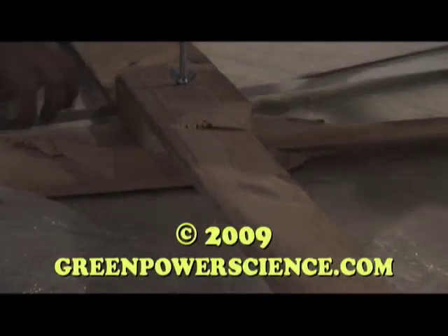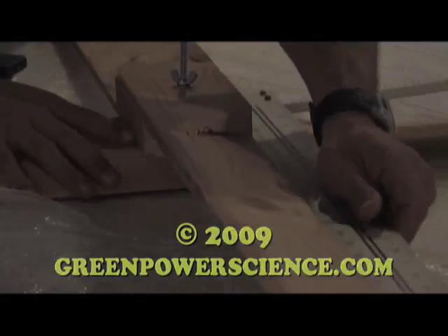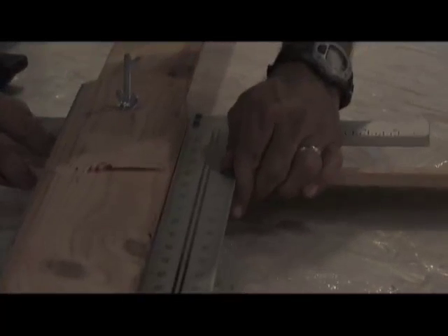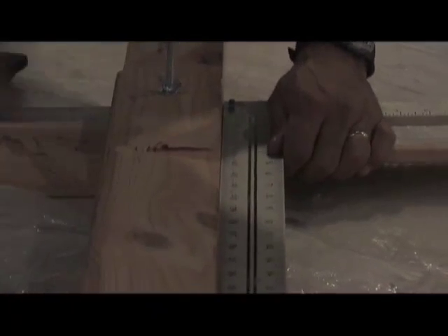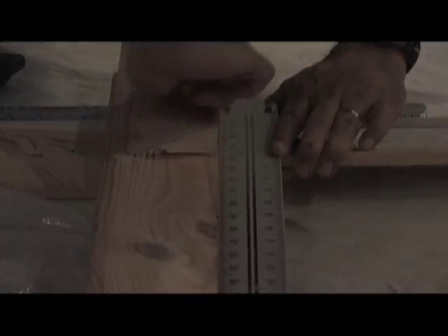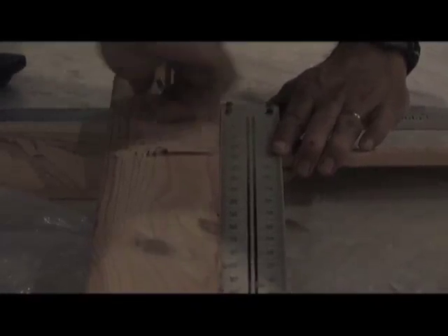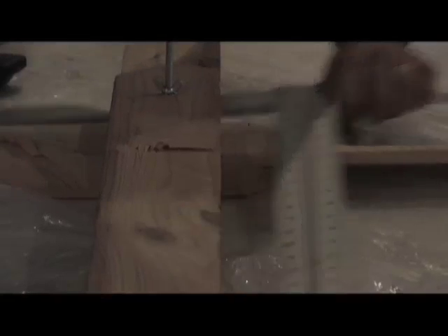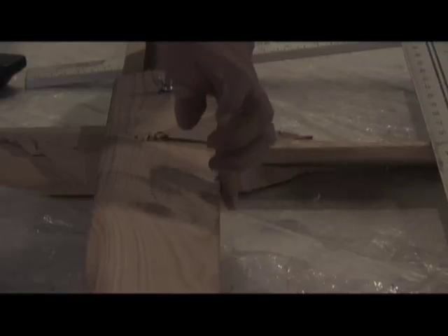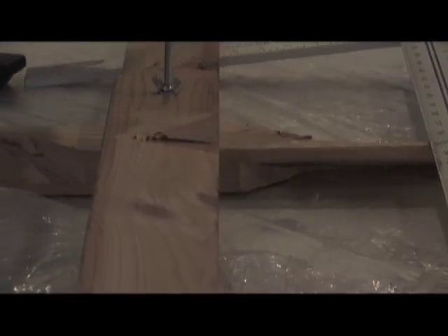You want to take your T-square ruler and go up underneath, flushing it against the bottom board. We've got it flushed here along this board, then you kick this in so that these are nice and snug. Hand tighten this as much as possible. So now these are square to each other — we've got a 90-degree angle there. That's exactly what we want.